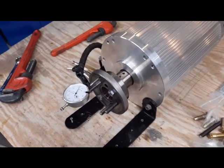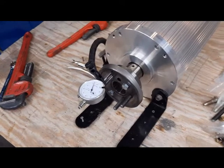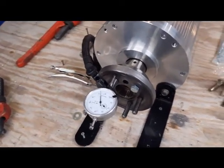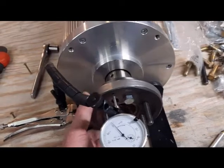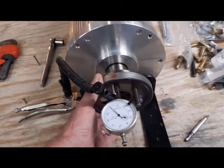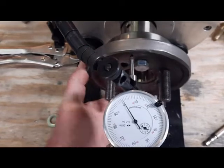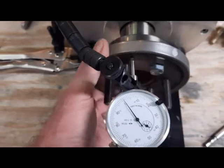I'm not an engineer — in particular motor alignment is not one of my specialties. But I do know you need to think in three dimensions. After I had the motor coupling on and the stern drive coupling on, and I had some runout, I thought I would check the face of the flywheel adapter. I've got the dial indicator on the face of the flywheel spacer/adapter and I'm spinning it — and it's like three thousandths out, which is great. I was going to send this thing out and get it faced, but I'm not going to bother now because that's nothing.